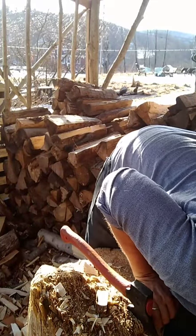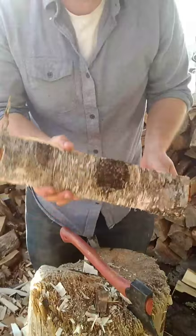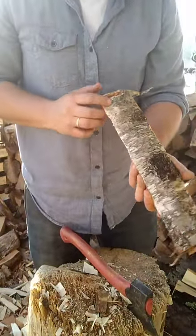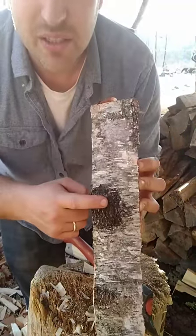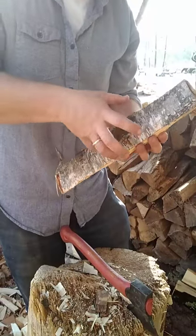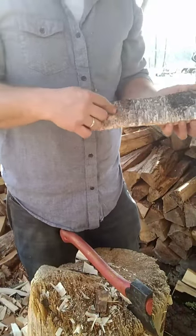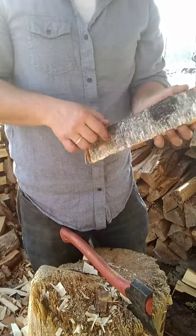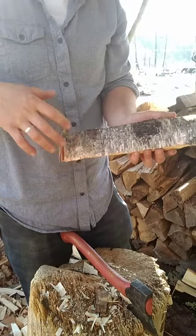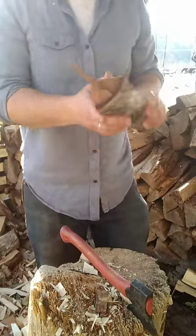With a piece of wood that has this funny swirly grain going on — you'd probably want to put the bowl here, because the process of carving the bowl is round and you can deal with swirly grain in a way that's way more of a pain in the neck if you put it in the handle. With the handle you want as clean a grain as possible so you can make whatever shape you want, and with the bowl it's fairly easy to handle that sort of thing.